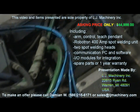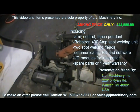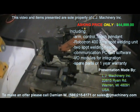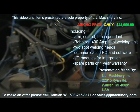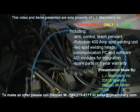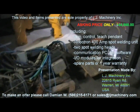With this system we have two spot welding heads — they're exactly the same. Each one includes a lubricator and grease pumps, which need to be mounted on the robot in the configuration you want. This also includes the couplings, all the wiring, necessary hoses and hookups. This was actually built for GM.